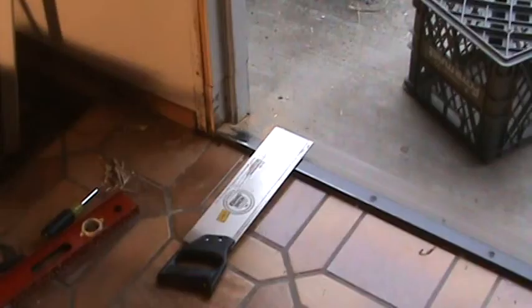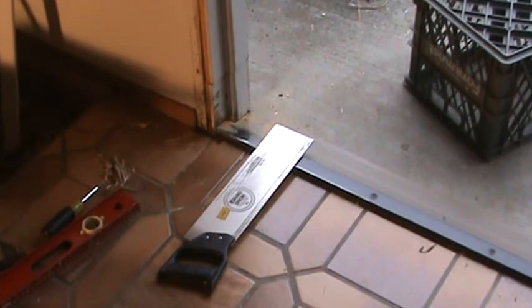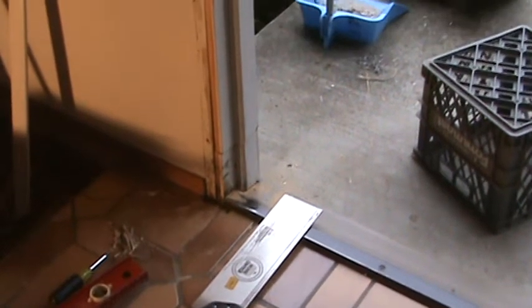Normally you'd rehang the door, but we can't go any lower because the threshold is right down on the ground. So I'm just going to cut out a half inch off the jamb, then pry this jamb down with a crowbar, lessen that gap, and reattach it down here and on the sides. My trusty little back saw — cost me eight dollars with the plastic miter box — I'm using that to run it sideways and cut off a half inch off that door jamb, then push her down.